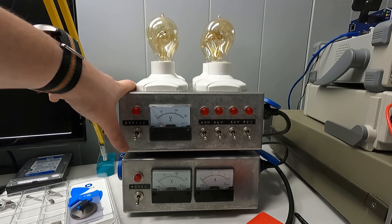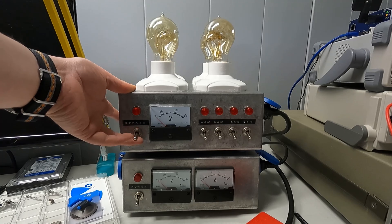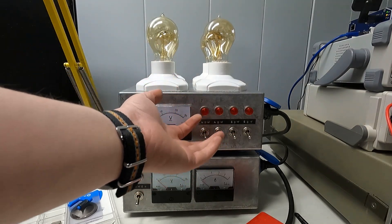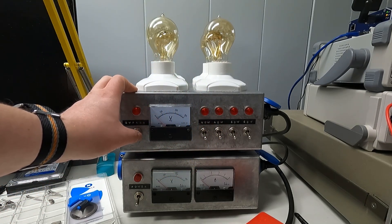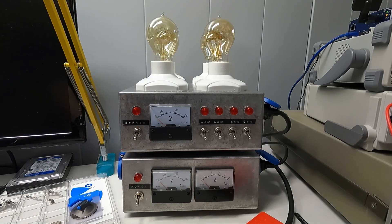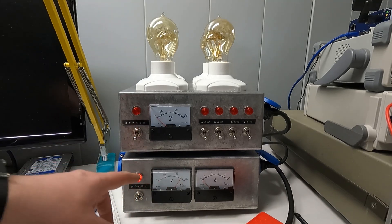This is a very good way to make sure you don't blow fuses. If you have gear that keeps blowing fuses, how do you figure it out without going through an awful lot of fuses? With this, you can set a limit below whatever the fuse is rated at — quite nifty.